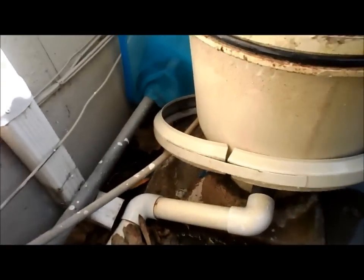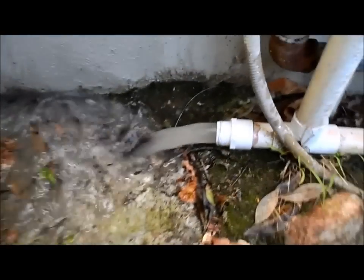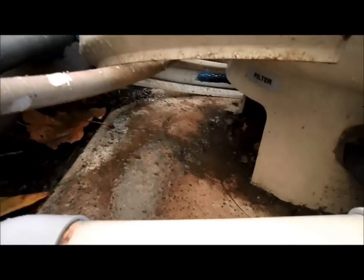Next thing we're going to want to do is open up the backwash, and it's right here on the bottom, the rotator valve. And we just push this all the way to the other end. As you can see, the water is coming out of the backwash at that point as I move that valve. It's very important to move that back when you finish the job, before you put the earth back in. Otherwise, you put the element in backwards, and it'll just make a big mess in your pool.